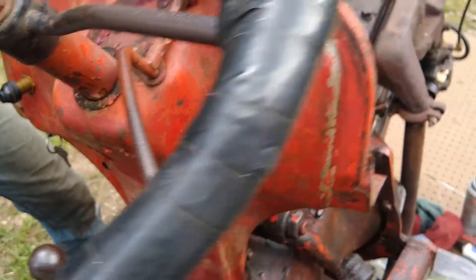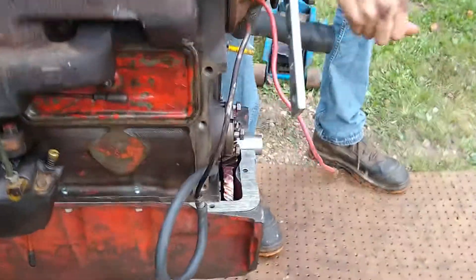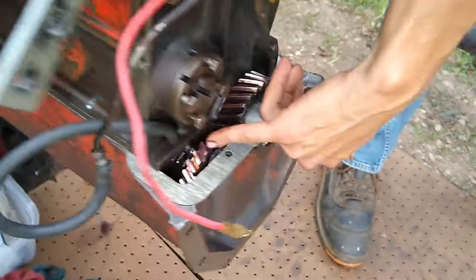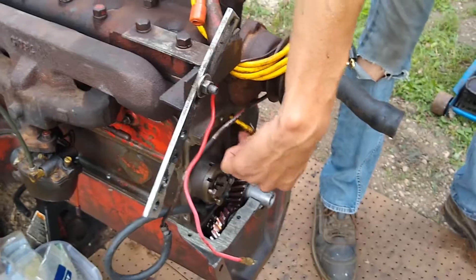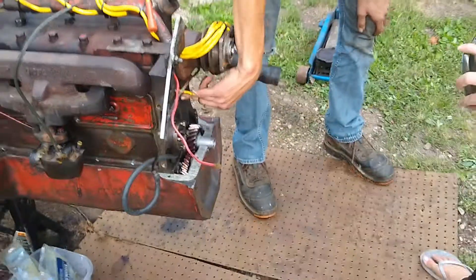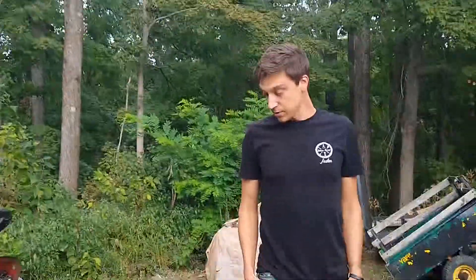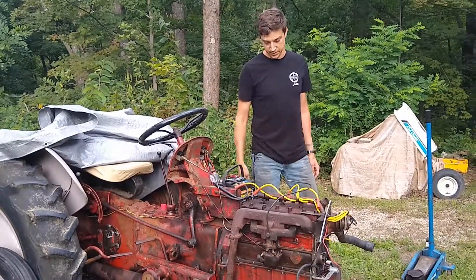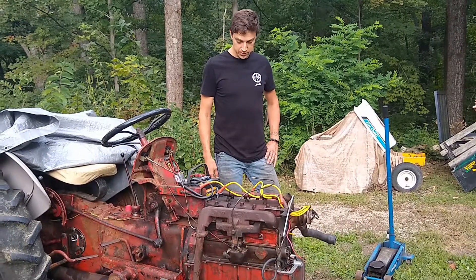She built some real good oil pressure — 50 is really good. And we're seeing oil pour right out of the governor feed, which is also good. We're probably going to get a little bit less flow because the pressure relief here has a little notch cut out in the spring-loaded plunger so that some of the oil drains down onto the gears. But all in all, that's good. It cranks good, sounds good. Each hole has some compression — you can feel it, at least. These aren't high-compression engines, so you don't expect a lot.